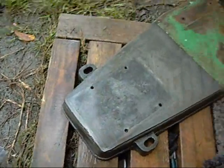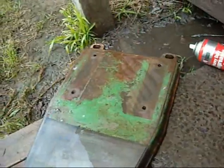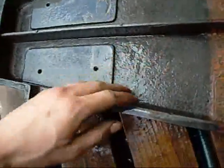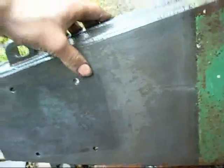This is the base for the pump unit — it's been in the electrolysis tank about 24 hours. Well, at least this half has; I've had it hanging off the rafters with a few chains from the top. And it's like day and night — you can see where the electrolysis has worked. Nice clean cast. This will oxidize lightly, especially when I do this end, so you can see what it was like before — not nice. I'm going to hang it the other way up and do the bottom half.